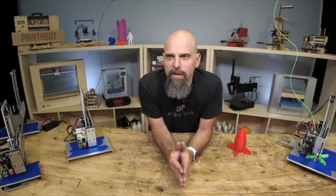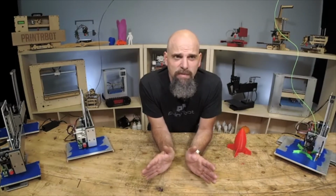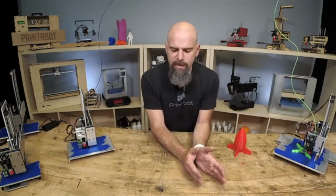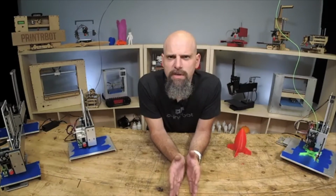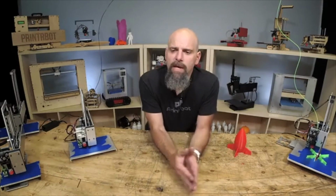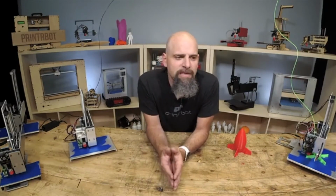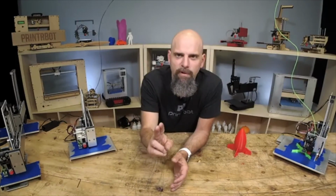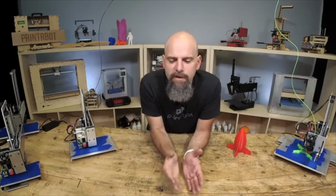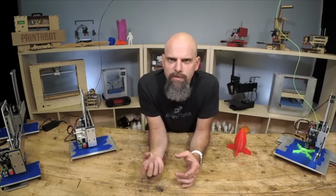Some are, like ShopBot, that's a Windows outfit. They are all Windows PC guys. They go back, CNC, they go back to when CNC was a parallel port on the back of like a 386 or 486. I mean, they've been doing it a long time. When I came in and started doing CNC machines here, I said, it will not involve Windows, and it will not have a parallel port. I need a USB port. So we found TinyG. And TinyG is the board that runs it, and it does have a USB port.